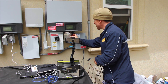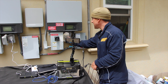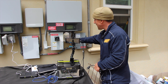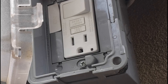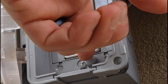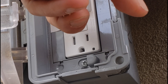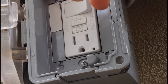So we can see here that the switch is on and we can do a GFI test — you can only do this when there's power applied. We hit test, that should break it, then hit reset and you'll see a red flash and then it'll go green. So even if you can't see the green light, if you do a test — let me move the camera down — because this light is so hard to see when it's green, what you can do is hit test, which will only work if there's power to the outlet.